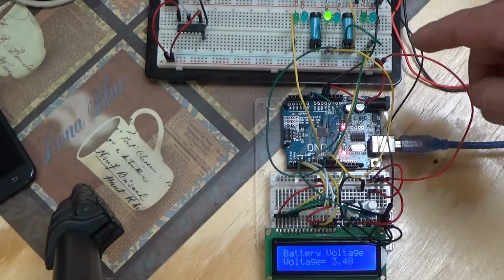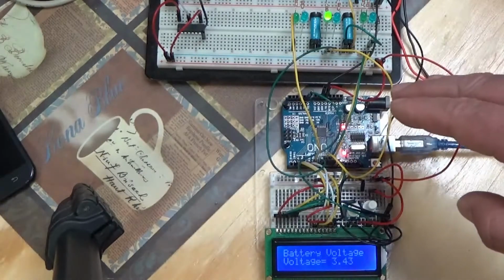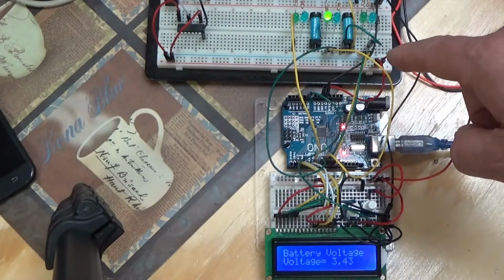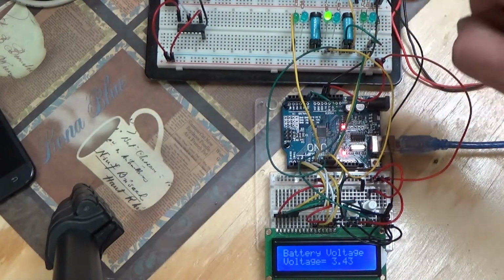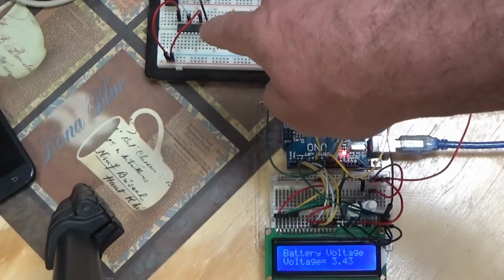Now obviously I want them in order because I'm going to have them labeled 1, 2, 3 and so on. Up to 8 computers eventually I'll be able to control with this one little Arduino. But it's working. We did see in the previous video that this relay does connect the power button of the motherboard and does turn a mining rig on and off at will. Now I've got to extend the capabilities.